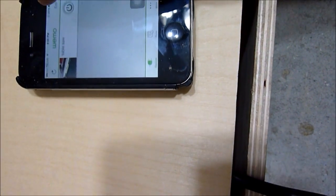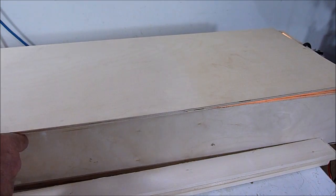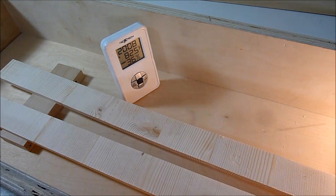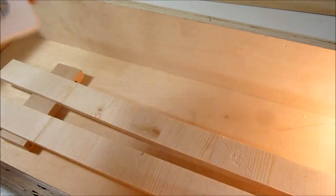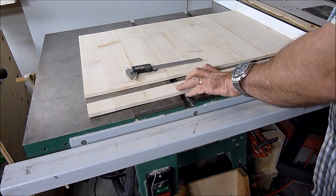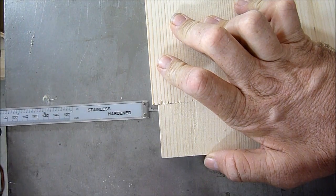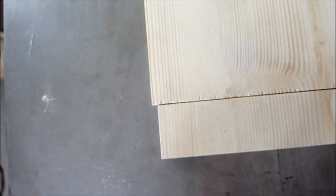This is a new gadget I got for my iPhone called a WeMo — it controls the on/off switch to my power supply. I'll let that sit overnight. My pieces have been drying overnight and it's now at 82 degrees and 36% humidity. Here is one of the strips I cut last night — putting it against the fence, it shrunk 4.75 millimeters overnight.